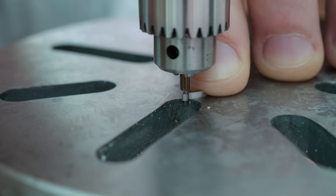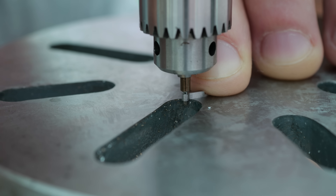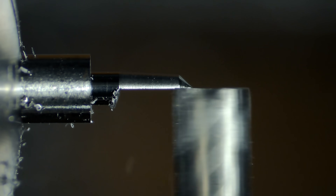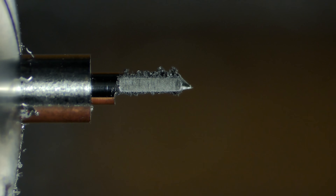Now I know I've made a dual reamer in a previous video, but this one is much smaller, so I wanted to show you quickly how this one is made through a microscope view. The difference here is I shaped the reamer entirely in the watchmaker's lathe prior to heat treatment, as opposed to grinding the shape of the reamer afterwards. I use a buff file to produce the clearance behind the cutting edge, leaving a tiny land.